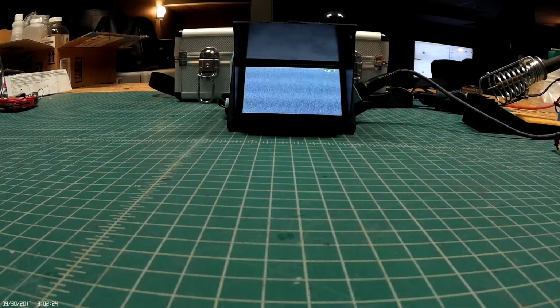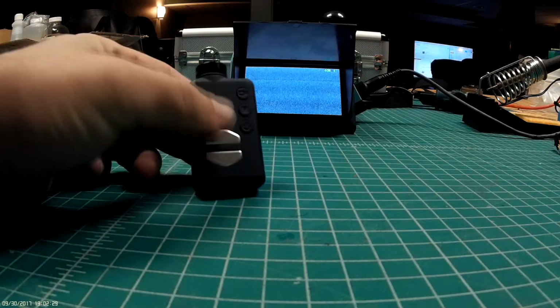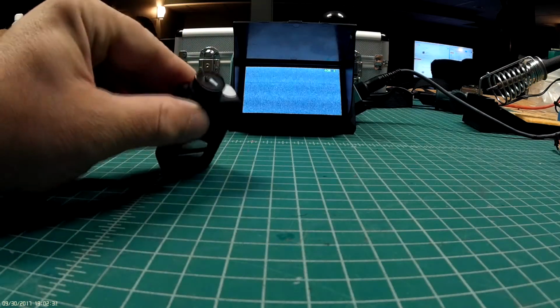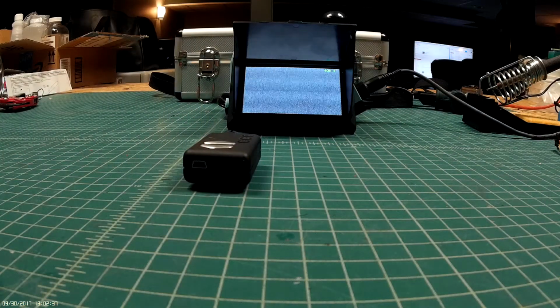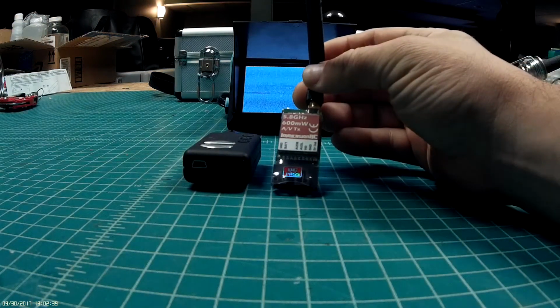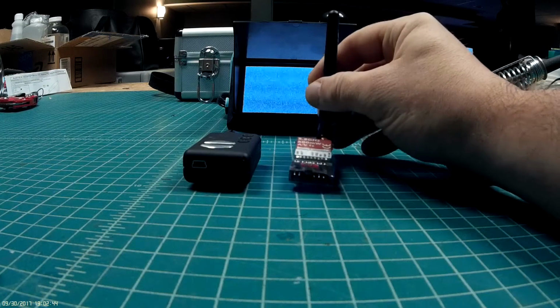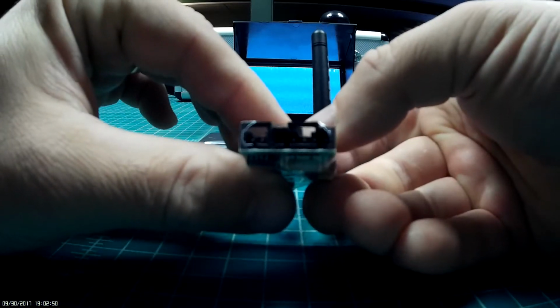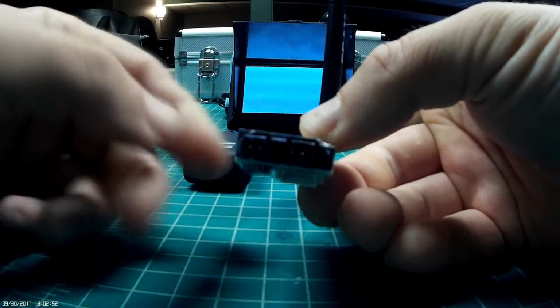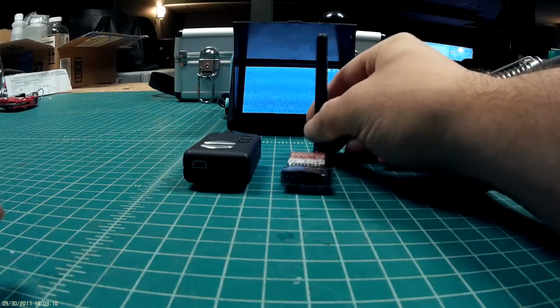to make it happen. Alright, so the first thing we need to do is get our Mobius cam. There she is right there. To do this, you'll need one of these. It can be either the fisheye or the standard lens, which is what I'm filming with. You're going to want to get an ImmersionRC transmitter. This video transmitter is 600 milliwatts. It has a couple of what look like just standard pin style connectors. Those are the pins we're going to be using to plug everything into. So we'll get to that in just a second.